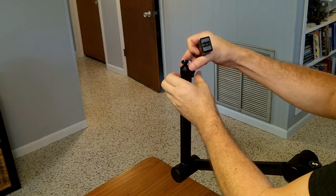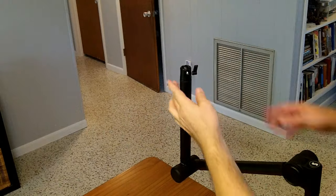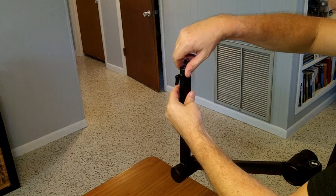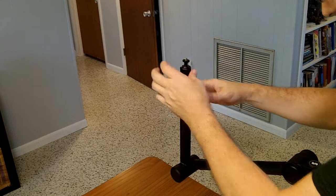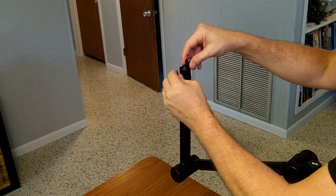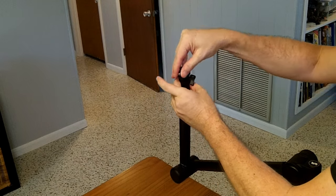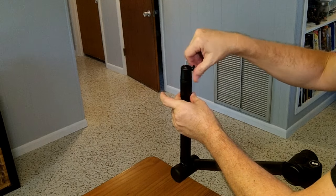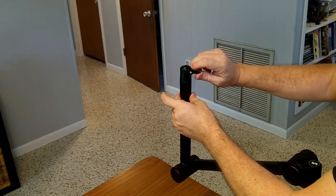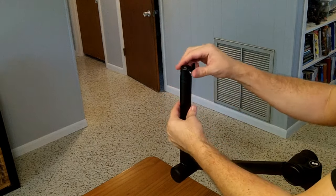This metal ball head has a 90-degree slot you can rotate into. If you loosen the screw a lot you can rotate the top of it around — so if you need to fold this up without the handle hitting the arm you can rotate it that way and tighten it back. Or if you want a 90-degree rotation you can spin around and put it wherever you want, and when you tighten it, it locks both the ball on top and the rotation against the bottom piece.